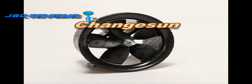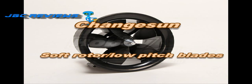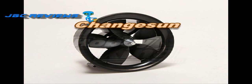Now this is not a good or a bad thing. It's actually quite a soft rotor in terms of the pitch, it's not very aggressive, so you'll need either a slightly higher KV or more cells to get similar output to a WeMo, for example.